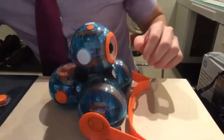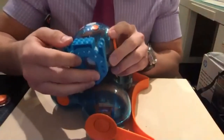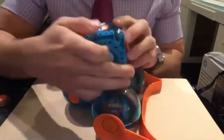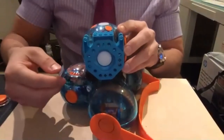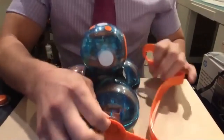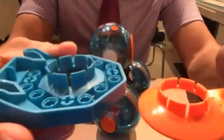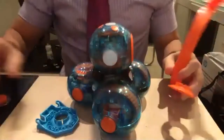Other types of accessories, like this one, a building brick, allow us to interface with Lego compatible bricks. You want it to have a more rigid and solid connection. And so you can see how this is not free spinning as well. The reason for that is because of the difference in the geometry of these two parts. And it's easier to see in CAD. I'll just try to show you guys briefly if you can appreciate the difference in height of those two components.